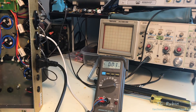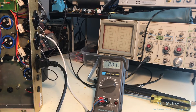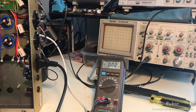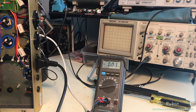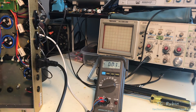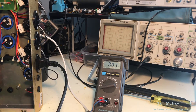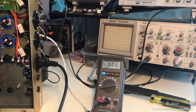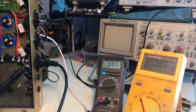At 90 volts I'm showing 30 watts, dropping as the tubes heat up. I can see the filaments glowing - that's a good sign. I do have the tubes on standby right now. We're at 98 volts... 100... 107 - just low voltage right now, seeing 40 watts, that's healthy. Now at line voltage - 50 watts on standby at line voltage. Everything looks healthy. I'm going to let this sit for a few minutes.